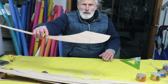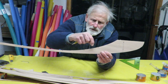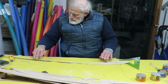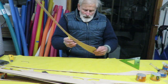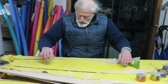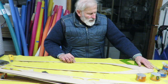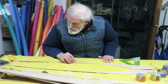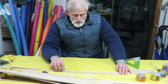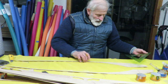You can see the 7a/7b lines and the short double lines marking the V-floor frame positions. Do the same on the other doubler. There shouldn't be much difference as to which side is up or down, but remember you want mirror images — you don't want two sides the same. If you laid this on top of the first doubler and marked it on the same surface, that would not be helpful.